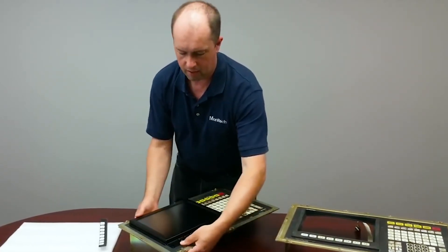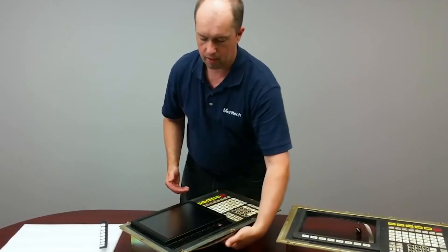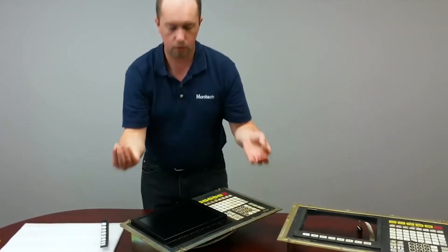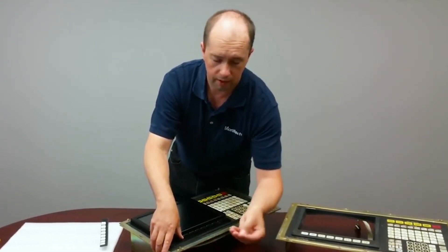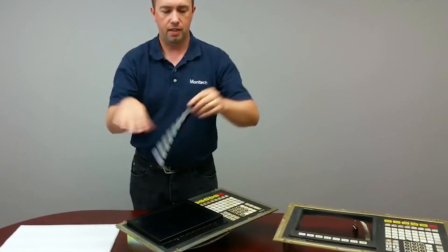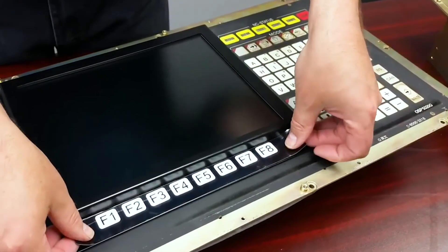At the bottom, your user controls — which are attached to the keypad controls — sit underneath. You push them up front so the button ends up level with this piece of metal. Put the screw on the top user control, then the nut, and that'll hold it in place. Once you have your four screws in place, apply the peel-and-stick function keys on the front.